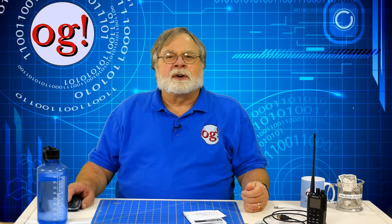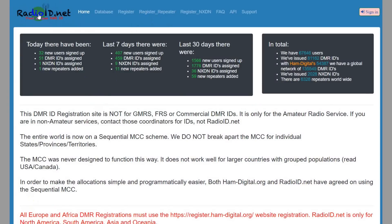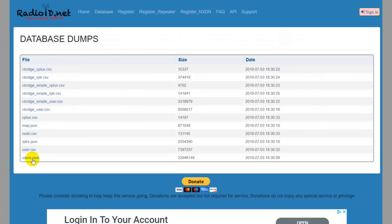I had a lot of trouble loading in the full list of talk groups. I was thrown at first but finally figured out that the talk groups are not in numerical order. I imported the BridgeCom list — this messed up my channel information. It turns out the radio keeps track of the call group via its position in the list, not the actual number. So, lesson learned: don't update the talk group list; add new ones to the end of the old list. I was able to load the file of all DMR users. The BridgeCom website says to download the JSON version and convert it to the CSV contact list using a piece of software they give you, but as it turns out, the CSV list is okay. You can find the most up-to-date contact list at RadioID.net — go to the database, then select Database Dump Files. The CSV list is the one you want.